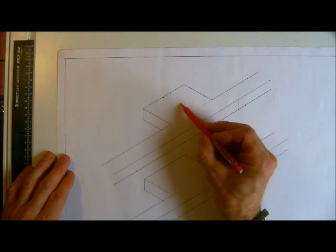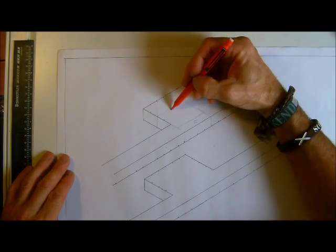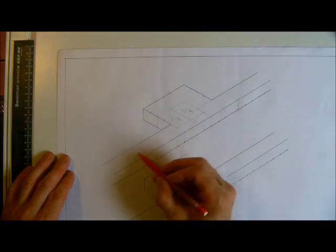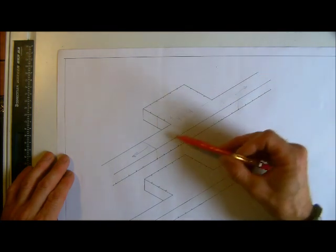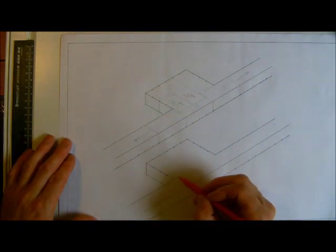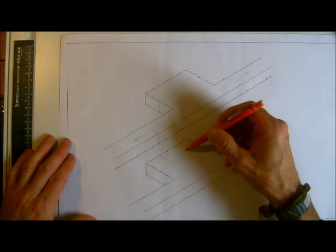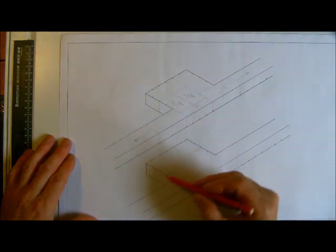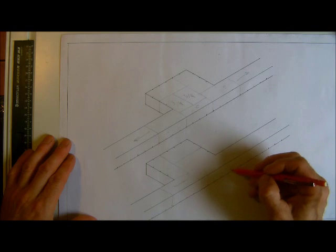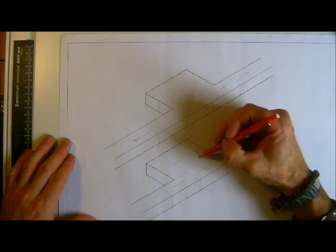If that went across there, we could go across there, and then we could have a closure here as with the garden wall, then two three-quarters, and back into stretchers both ways. You can see how that bonded round — one side of the pair tied in, the other side butted up. When we come to the other course, it's exactly the same but in reverse: that brick there, this stretcher on this side — header on one side, stretcher on the other, bonded round nicely. The one that butted up means this one has tied across, and to maintain our stretcher face this one tied across as well, and there again are our two three-quarters.